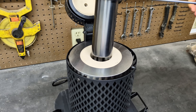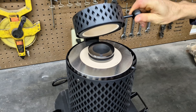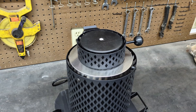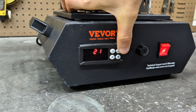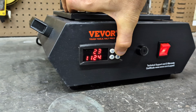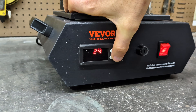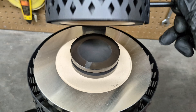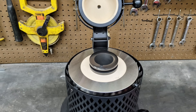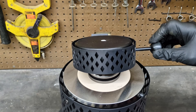I'm going to place this crucible into the furnace, power it up, and get this thing started. For this electric furnace, you have a few buttons. You want to press U and an up or down arrow to adjust the temperature. Then when you're finished, hit P. You will then have an equal sign flashing — that means your furnace is heating up. It's now reached 421 degrees Celsius. I'm going to add some scrap aluminum to it, and while I wait for it to melt, I'm going to make a mold.